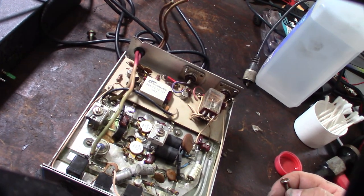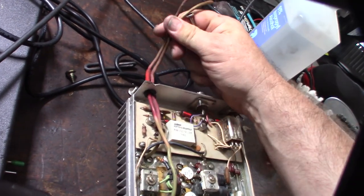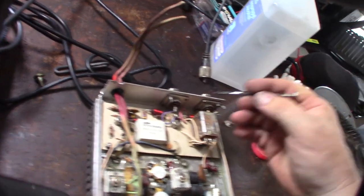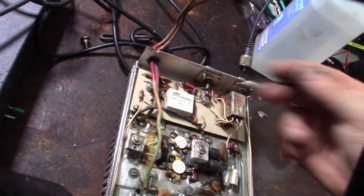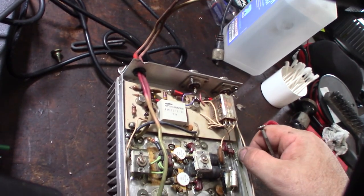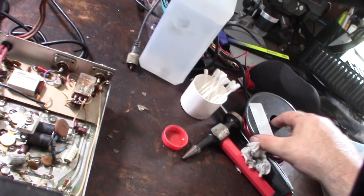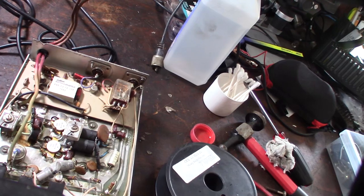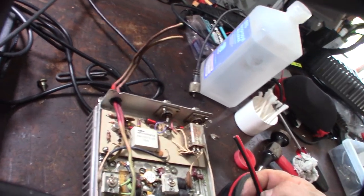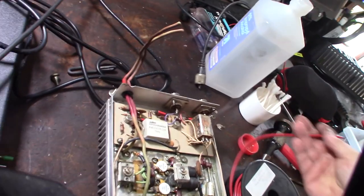This lid must have been off for a while because these wires were exposed to the sun - they were red wires at some point. You can see where it's still kind of red. I could replace all the internal wiring. As long as they're getting good contact it might be fine, but I'm thinking about replacing them. I have some 14-gauge wire I use for 3D printers. I think I probably need maybe 12-gauge or 10-gauge wire.